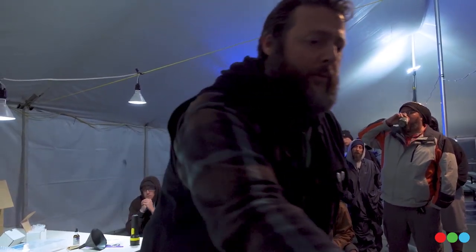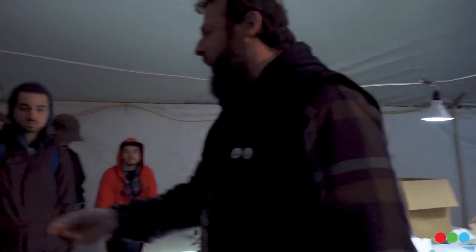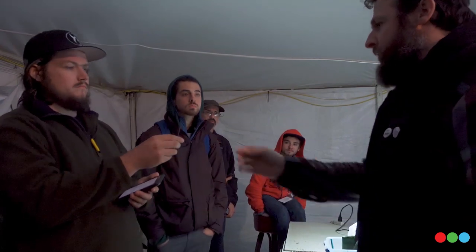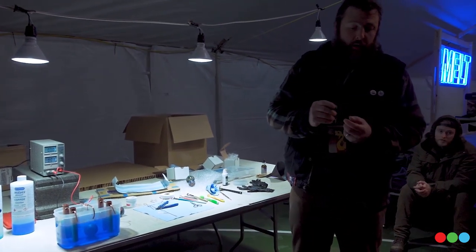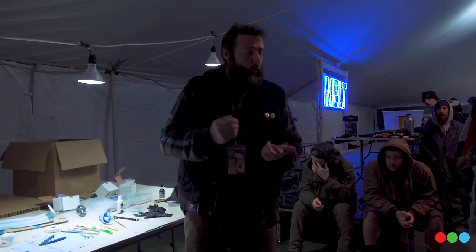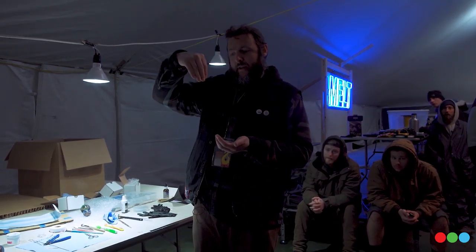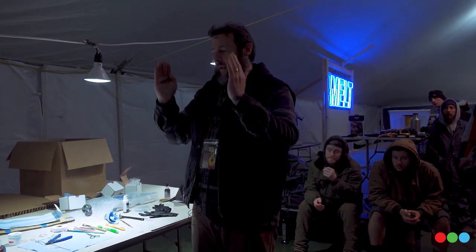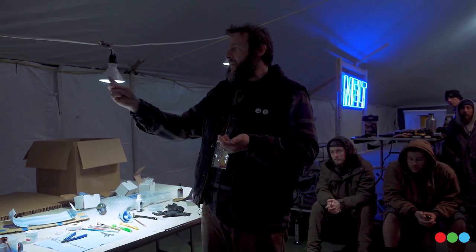The reason that tool has been so good to me is because copper is pretty soft. And so if you have any weird little artifacts on your copper coating, what you can do is kind of scribble on it. You grab your piece and, oh, I felt something there, and I'll use this little tip, and I'm not using force, I'm just gently scribbling on it. And then sometimes there's a sharp edge where you carved down in that groove, and you need to get in a tight spot. And so this end works really good.